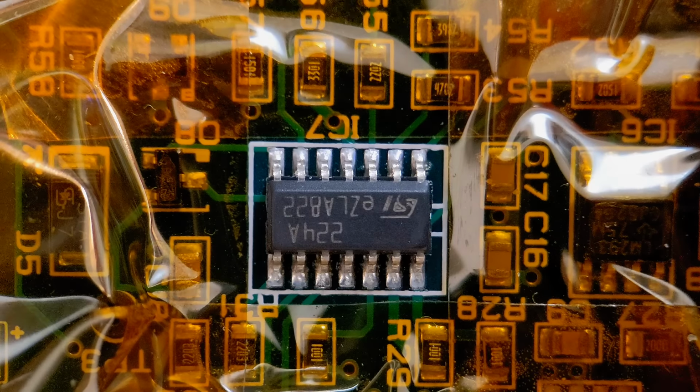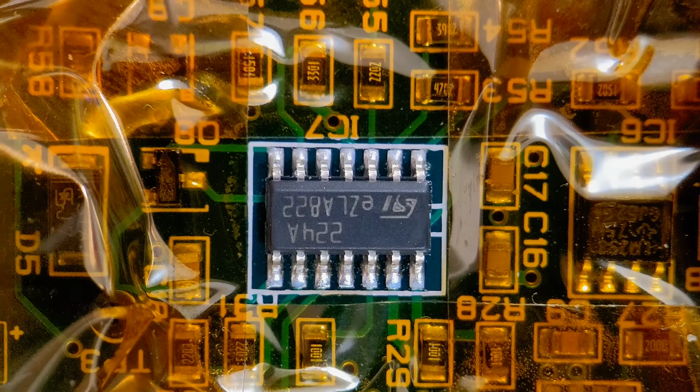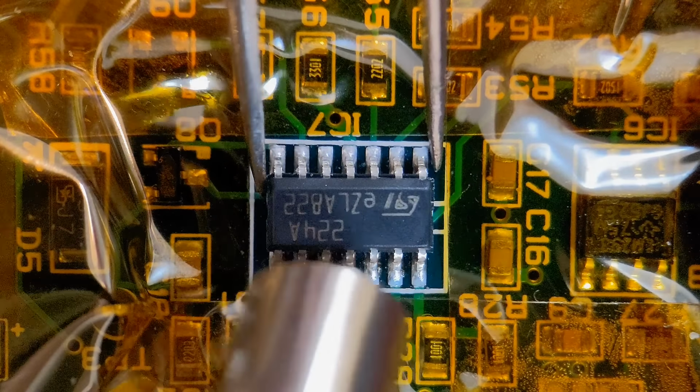Now, like I said earlier, Kapton tape should work well with this because these components aren't too close to the device being removed. But you'll see later on in the videos the tape I actually prefer when I do this sort of work. Let's just circle this device, get all the joints heated up. Just be patient. It should be off any second. Let's get that off. Let's just lift that off.